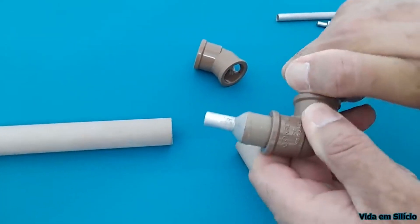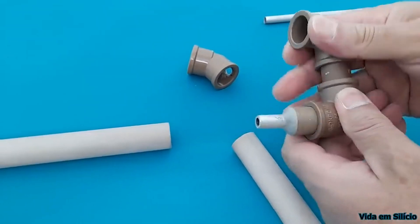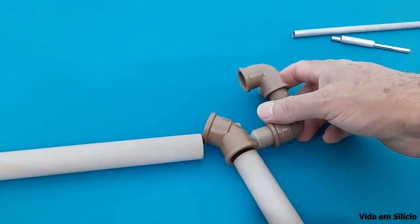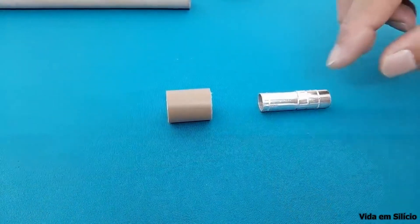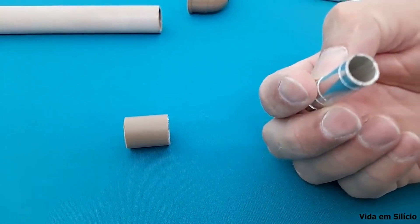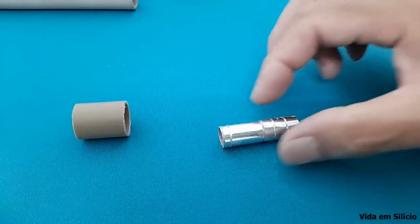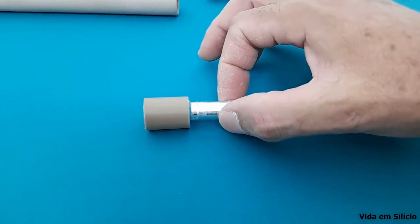So let's put it in. Let's glue these two pieces here at the back and connect them to the pipe. So let's glue all this together. To attach the hose to our water pump, I prepared this little aluminum tube with a diameter close to the hose hole. Here I made some grooves — these three are used to hold the hose, and this one will be used to hold this tube inside with epoxy putty. This tube will be attached to this structure later.